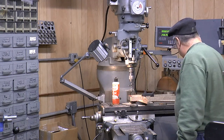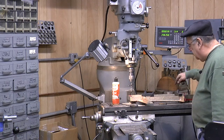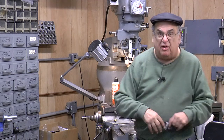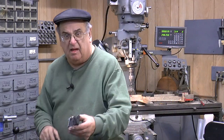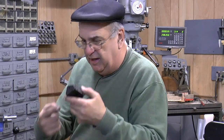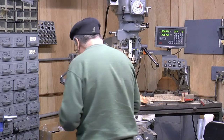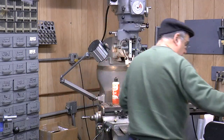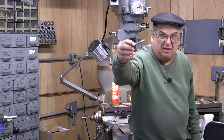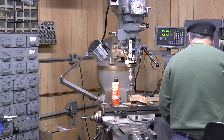And I milled out, you can't see it maybe here in the picture, but slots here, similar to this, the aluminum piece that broke. Put that slot in there so the brake hanger can go in, pain in the neck. So probably wider than it needs to be, but you got to use a long 3/8 end mill, a two fluter I had. Anyway, I'm tapping the holes down.